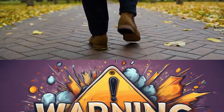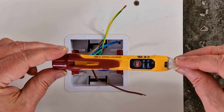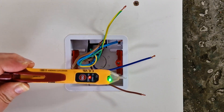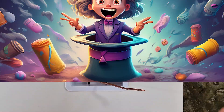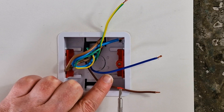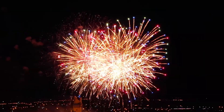Warning! Unfortunately, this step needs to be done while the power is on, so please be extremely careful. No heroics, just safe and smart testing. The best tool for this is a non-contact voltage detector pen — a must-have for any aspiring electrician. If you don't have one, a simple screwdriver with an electricity detector will also do the trick. Once you've identified the live wire, turn the power off again, then mark the wire so you can easily recognize it later. Double-check everything — wiring mistakes can lead to short circuits, blown fuses, or, in the worst case, an unexpected DIY fireworks display. Safety first, always!